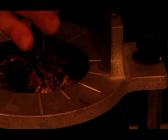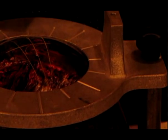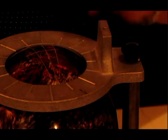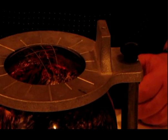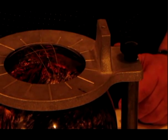The reason for that is when I put the pitch plate on top of the jig, I can then move the ball until the drill bit drops down into that little divot. And as long as my lines are still aligned, I'll know I have my proper pitches and that I won't take out too much of this line that defines where my thumb goes.